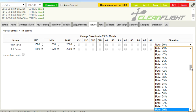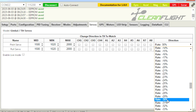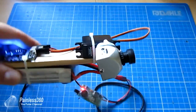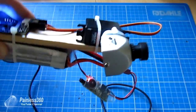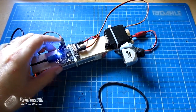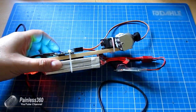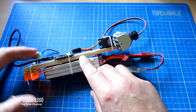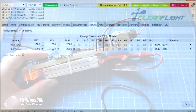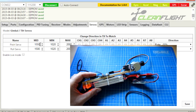Rather than being a positive number, change it to a negative number and vice versa. I'll go down to about minus 30 and click save. Now we can see that's kind of working, but it isn't quite working well enough. That 30, although we're in the right direction, is pretty close — we might need a bit more. The other thing I'm not happy about is the camera isn't pointing straight out. We can adjust that by changing the midpoint. I'm going to increase the midpoint by maybe another 50 — let's just see what that does. I'll make the midpoint 1550 and click save.